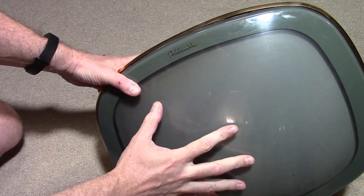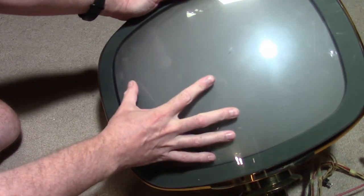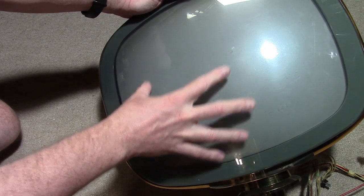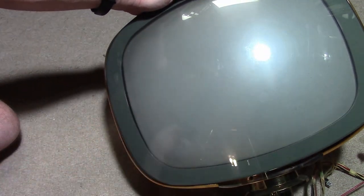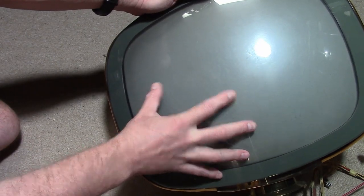Now the screen cover is in very good condition and it looks to be rather clean, however this is decades old. Static electricity builds up on the inside surfaces due to the high voltage and contamination tends to find its way in there and get deposited both on the inside of this cover and on the glass CRT within, so I'm going to take this off and clean it.